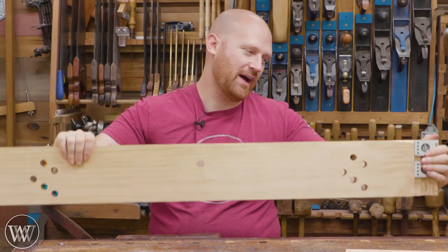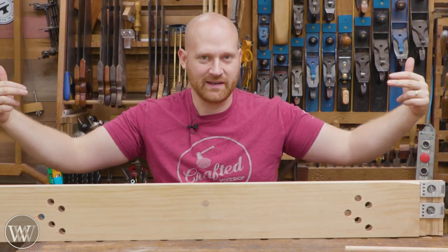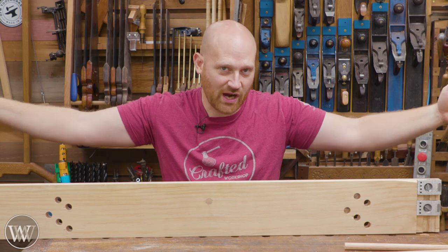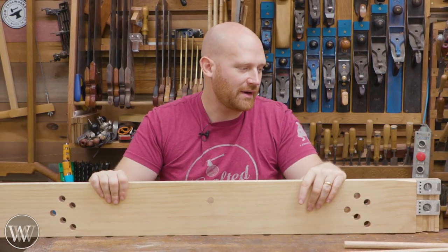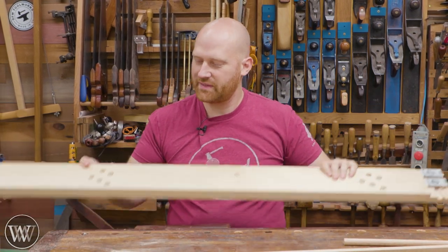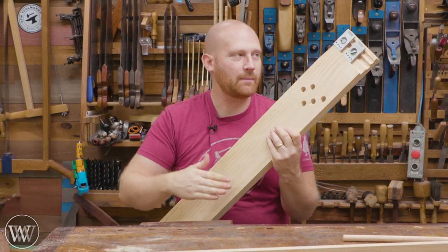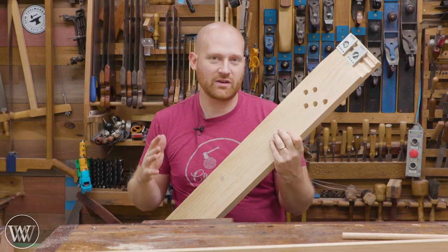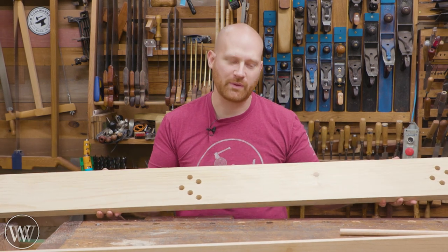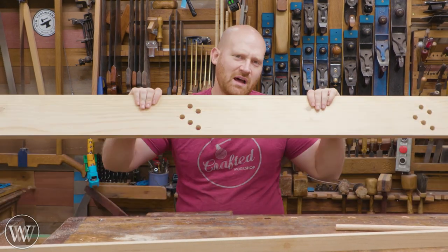So there you go — sticking board. This is great anytime you're using molding or doing long thin strips that you want to all be the same. You really can't clamp them end to end because they want to pop up in the middle, so this is what you want. I'm limited to just a little over six feet long due to my shop size, but if I had a bigger shop I'd probably make it about eight feet. With this setup, I can move the fence in and out, change the stop heights, and plane stuff down to an eighth of an inch. You'll often see me use double-sided tape to stick things down to the bench to plane them — this is a lot more elegant than that.